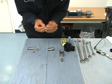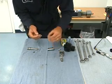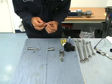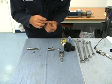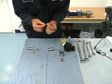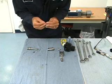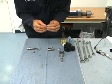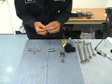We'll push it on, and then next is our buttress. The buttress, like the buttress in our bleed-down valve, is flat on one side and chamfered on the other. We always want the flat side to meet up with the flat side on the seal. So we push it down — about that far, just so I can barely hold it with my fingertips.